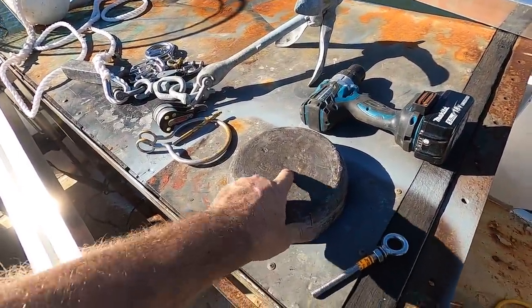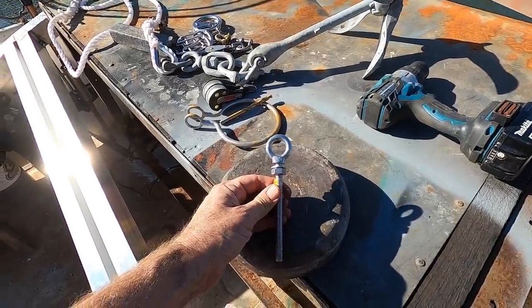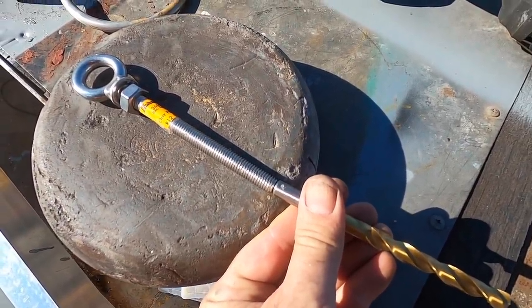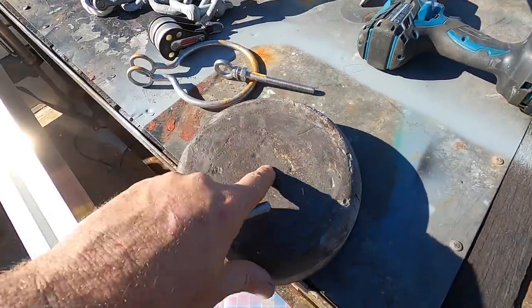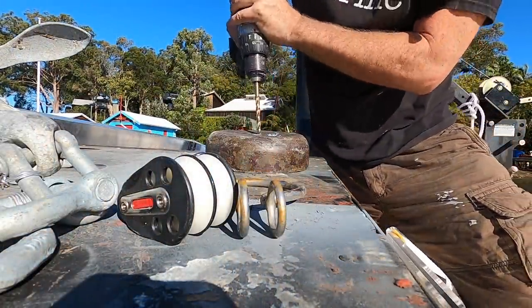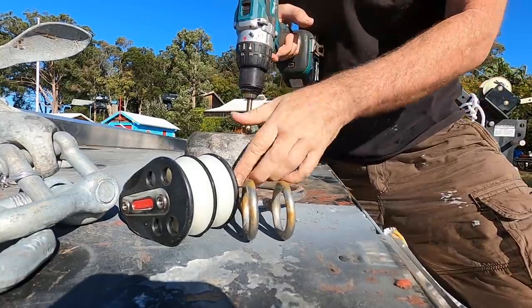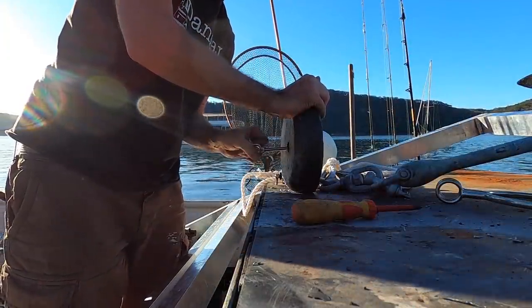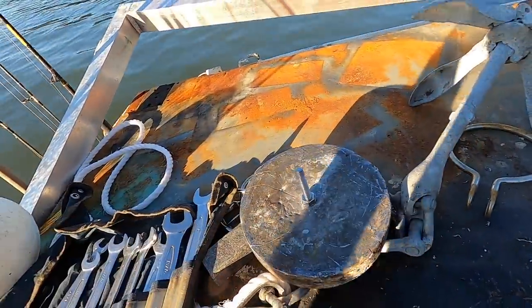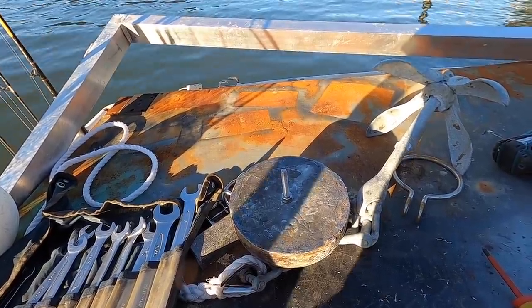While I'm waiting for the paint to dry, I'm going to drill a hole through the centre of this lead weight - this is going to be one of our main search weights. I want to put a stainless eye in it, so I'm going to try drilling it with a 9mm drill bit. Lead actually turned out to be a real nightmare to drill because it's sort of really goopy - it's soft but it binds up really, really tight. Probably should have done it on the drill press but got there in the end. Part of me is tempted to cut the excess thread off, but another part of me thinks it might actually be quite a good spike when it hits down into the sand or mud to help secure it.